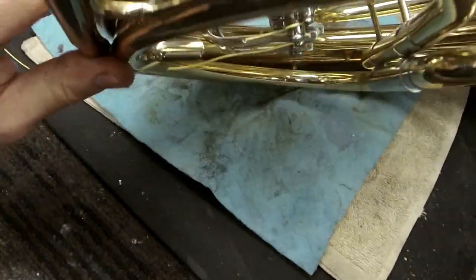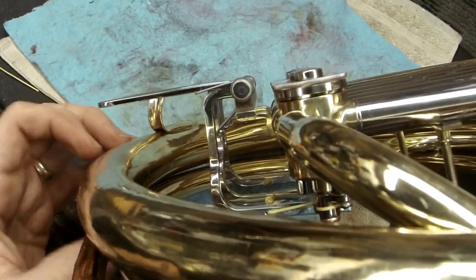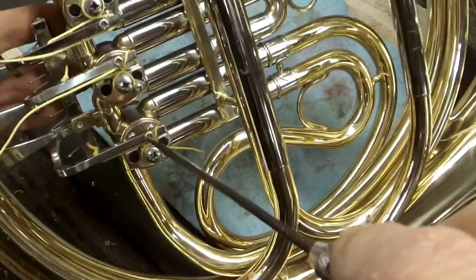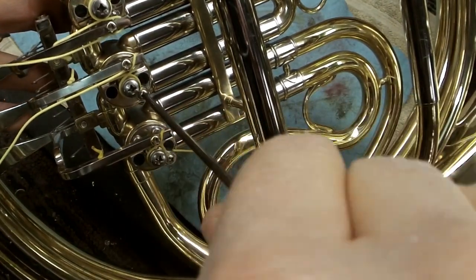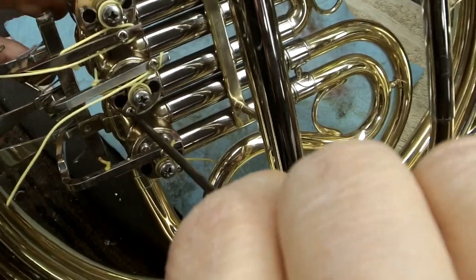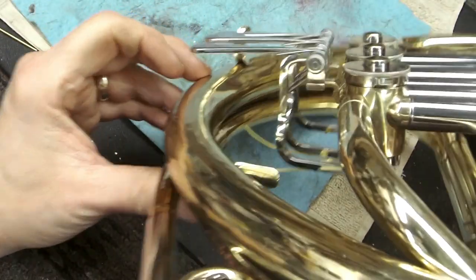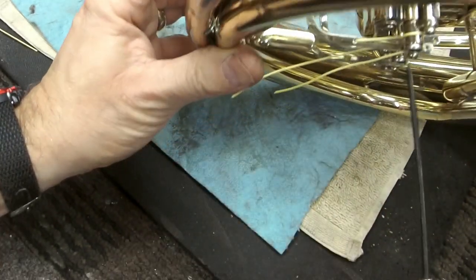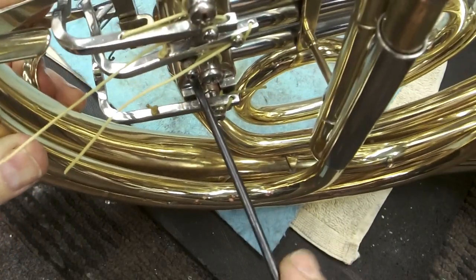This stop arm screw is not tightened yet — that will be used for our adjustment. Look at the lever, it's way low — no problem. Push up on it, it should move freely. There's the alignment. Go ahead and tighten the string screw on the stop arm. If it moves, push it down and tighten it. If it's off, readjust: push it down, take out some of the tension on this screw, then tighten it back — and that's dead on the money.